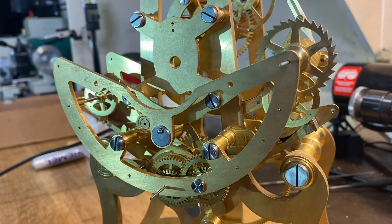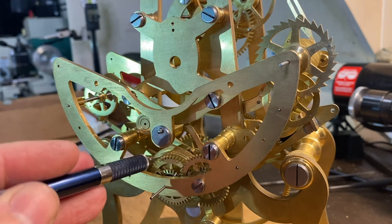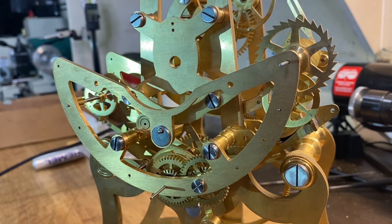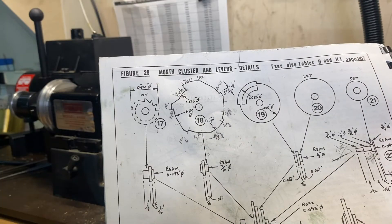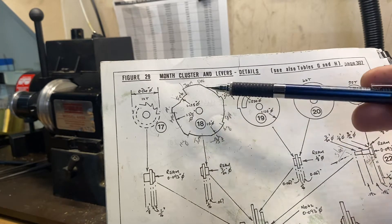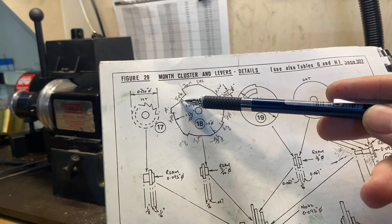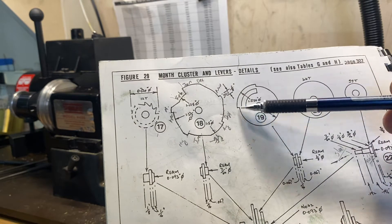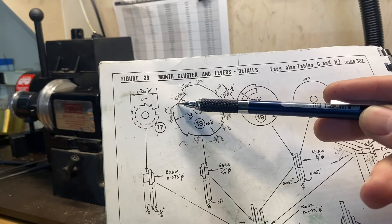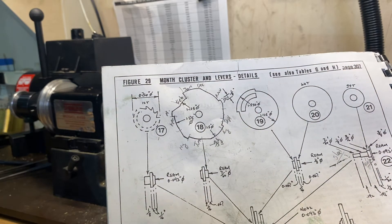The trick is the calendar. We have to worry about leap year every four years. Down here we've got a month cluster that tells us what month it is, and there are 12 different parts on this. Here you see the drawing of this cam — this is the most important cam for the month cluster. It's got a different height for each month, the lowest being February and the highest being January. It's got another wheel with a height step that will clip the lower portion of February, so when February has 29 days this piece will get in the way and won't go as low.